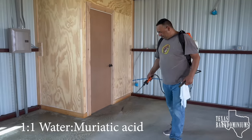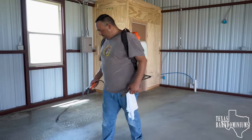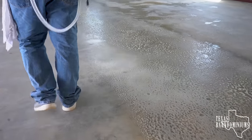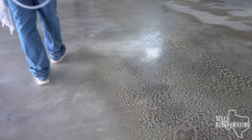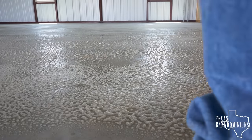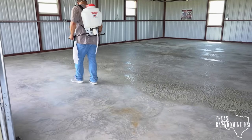After your floors are spotless, now you can acid etch. The way I like to acid etch is a one-to-one ratio of water to muriatic acid. You want to end up with about the equivalent of a 400 grit sandpaper — you want those floors to be etched. Make your mixture one-to-one muriatic acid to water and apply with a sprayer in a circular motion. The circular motion is gonna prevent you from getting patterns on your concrete and give you a better chance to get really good coverage. Make sure this entire thing is coated — go ahead and etch the floors completely.